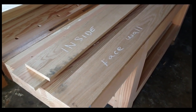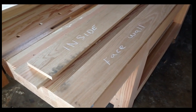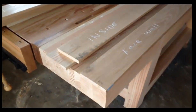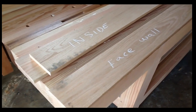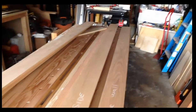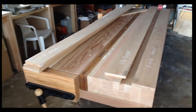Pencil is one of the worst — especially on soft wood you almost leave an indentation trying to sand it out. And of course masking tape nearly falls off. If you're in dire need of using just pencil, mark it somewhere it won't be seen. But you just can't go wrong with chalk — it's clearly visible and comes off real easy. These are the pieces I'm going to start fabricating. See you in a little bit.